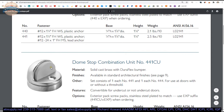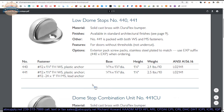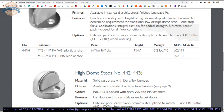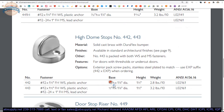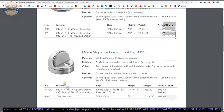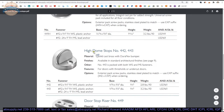There's a combination unit comprised of a 441 and a 444 riser, which is 3/8ths tall. If you're not sure how many lows and talls you need on a job site, you could order the 442 or 443 — which has a half-inch base height — and order some shorts, some talls, some combination units, or all combination units.